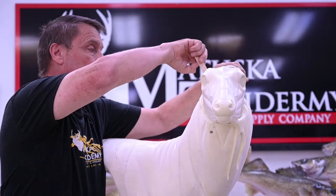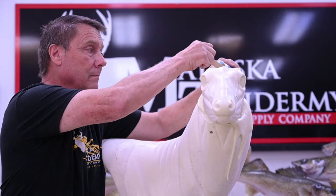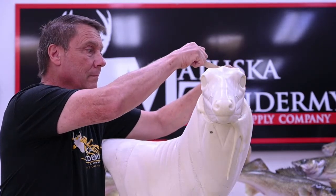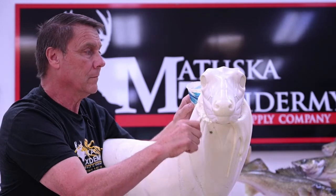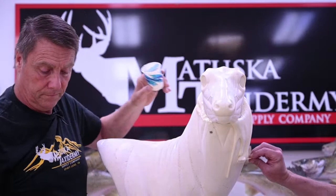And worth noting too, if you do spill some foam, if foam does hit the floor and you don't happen to have paper, let it set up. Don't try to get it now. You'll make a mess. Later on, it'll just pick off as one nice solid piece. I don't know if you want that over there. Yeah, I can bring a little bit up.